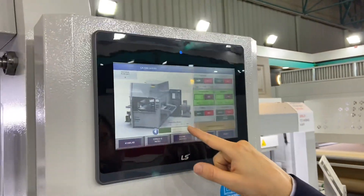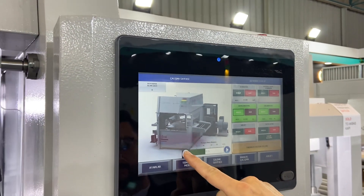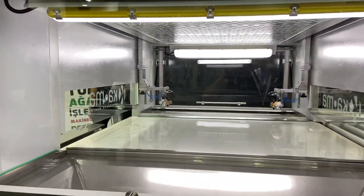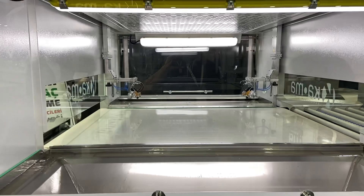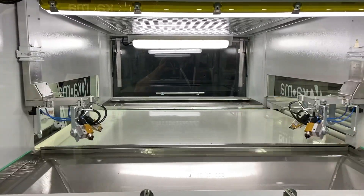This is the pump air pressure — if you increase it you spray more paint, if you decrease it you spray less paint. We have two arms here, and the heights of the gun arms are adjusted with these handles, very practically.